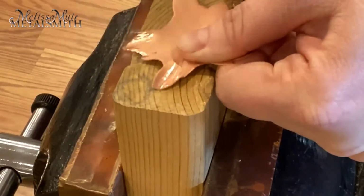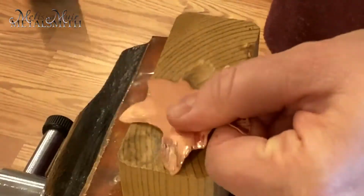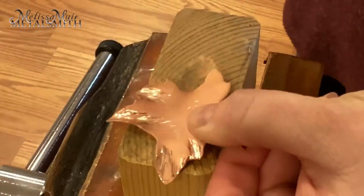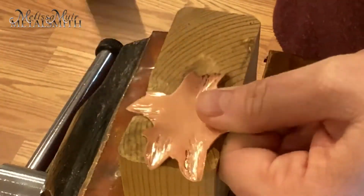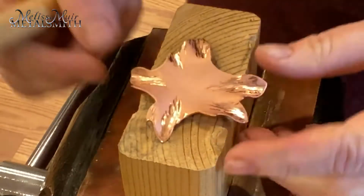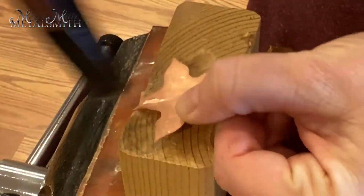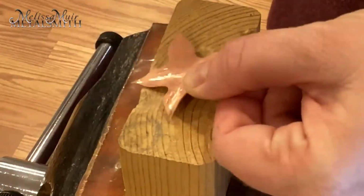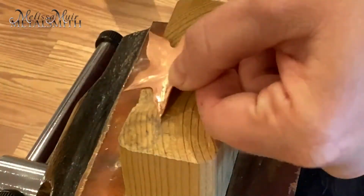Pay attention to how the metal is moving, and you can do all sorts of things. Before this step, I do find it helpful to anneal the metal. It will make it much easier to work with. I do not need to hammer the entire layer, as most of it will be covered with the layer above it. Notice on the second layer, I'm actually forming from behind so that I don't ruin the texture I have already placed onto the piece.